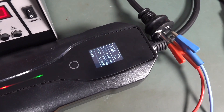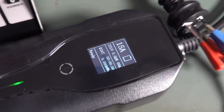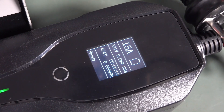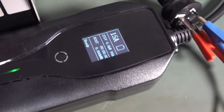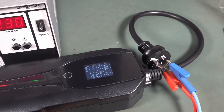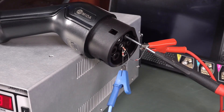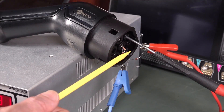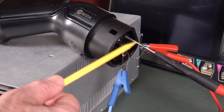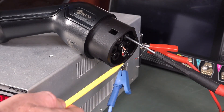Oh no, it does have kilowatt display — it does have kilowatt-hour. There you go, didn't have that in the manual. 24 degrees — so it's got an internal temperature sensor, as I suspected. It doesn't know the earth is missing because it's got no way to detect that — I don't actually have the earth connected. Put a 2.7K from the earth through a series diode through to the control pilot pin here, and that will determine that it is connected.